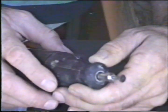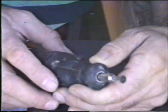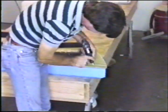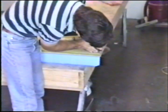This next section of tape is rather noisy, so we're showing you here a 3/8" Dremel saw attached to a Dremel tool. We're going to cut down the center line of the leading edge with this rather noisy beast. This can be done with a hacksaw blade. It can be done with a small handheld Dremel saw. This tool probably isn't the best to use because it generates a bit of heat and melts some foam away from the center line cut.